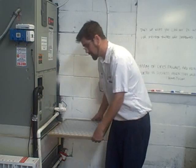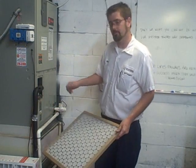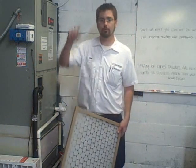The one-inch filter is normally found beneath the evaporator coil at the bottom of your air handler, where the air enters the system. They can also be found in a return grill in the wall or a return grill in the ceiling.